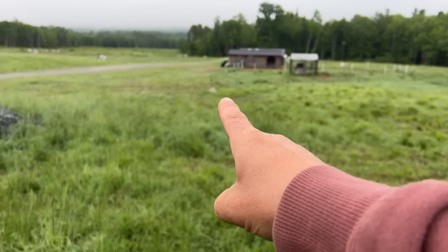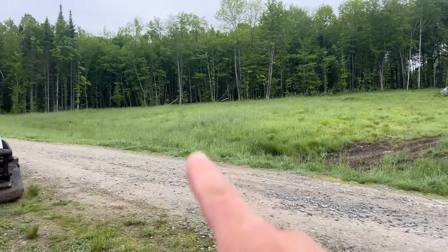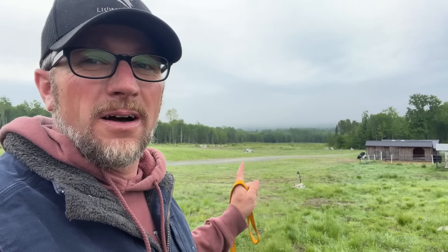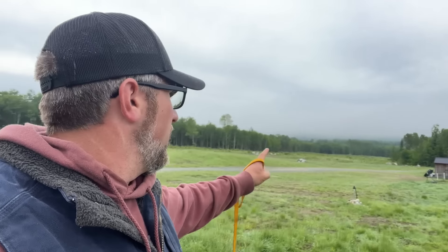That's the hydrant we're going to tie into, and we have one more over there — the spring is up there. When I did all these water lines I left a longer tail on that hydrant, but for some reason when it's left on for a while you see water coming out of the ground. So we're going to dig up that hydrant and figure out what the issue is. I'm not sure if it's the hydrant itself or a leak somewhere else, but it only happens when the hydrant is on, which is a good thing — we don't leave it on all the time.